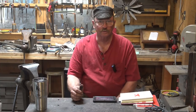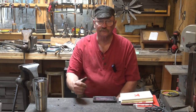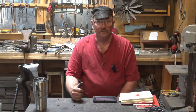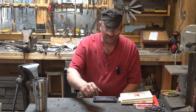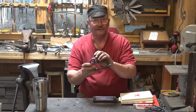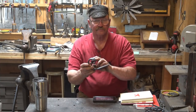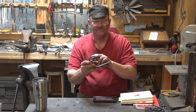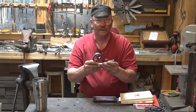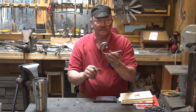That would be the hay penny scroll and the bolt end scroll. I've seen the bolt end scroll called a fishtail snub end scroll. The hay penny is not that difficult but it has a little bit of a twist to it, so it's worth doing as a separate video. This style of snub end scroll is often done in a much heavier bar — something like a half inch or three quarter inch thick bar for big work. Then you don't need to add mass. You just offset what's going to be the snub off the anvil, draw out the scroll behind it, leave that mass behind, and put a nice graceful taper in the end until you get back to your original bar thickness.